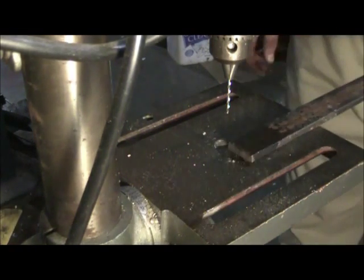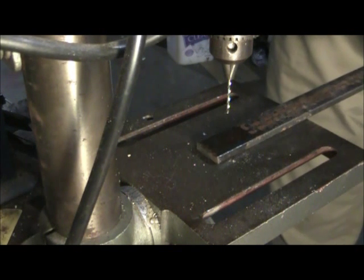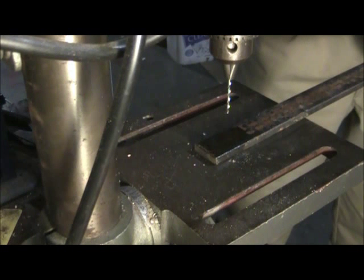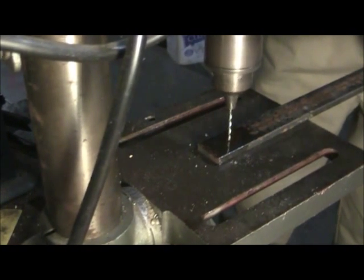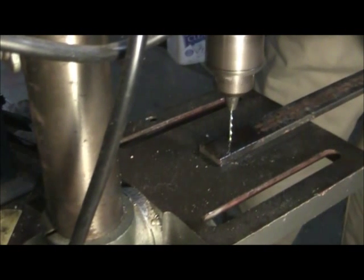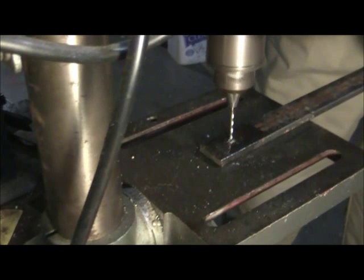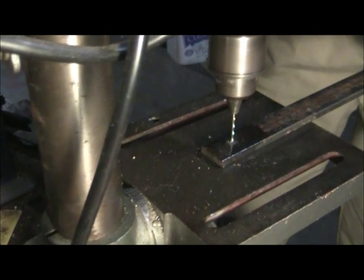I just got my light over here so I can see. Smaller drill bits you'll probably want to run a little faster than a larger one. Normally you would have a vise, but I don't, so I'm going to just have to hold it. Go very slow — you can't go too fast or you'll screw it up or break your drill bit. Press it until you see these little swirly things coming out.